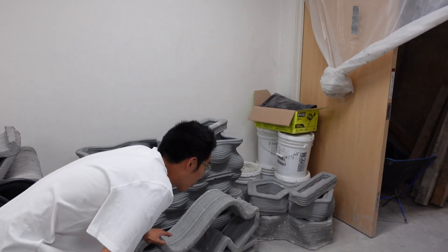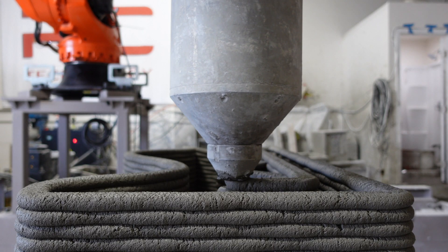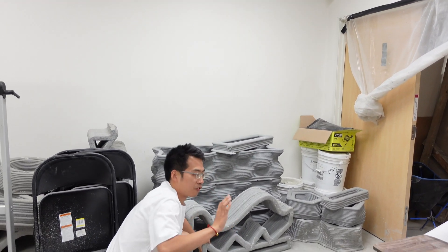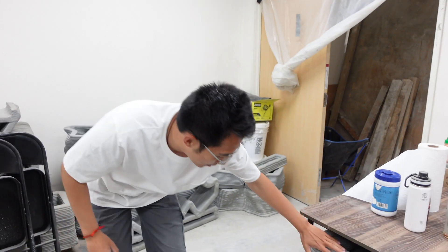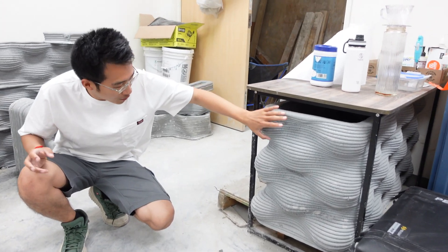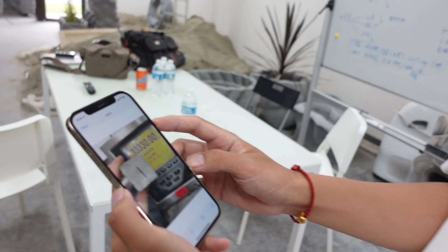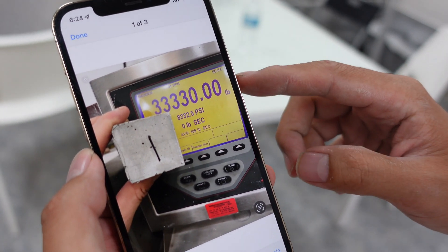This is a smaller version of the print we just did. As you can see it's all cantilevering here — this is after about a week. Normal concrete really lacks cantilever strength, but with our material we have a lot of fiber inside it, so the cantilever is still strong. This bigger planter we're actually turning into a fireplace — it was printed in one continuous go. As you can see, everything is cantilevering and waving — that's one of our high-strength materials.